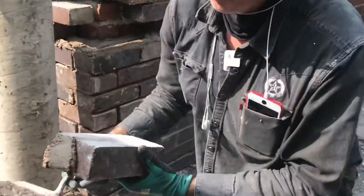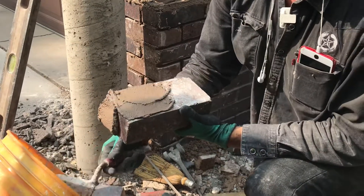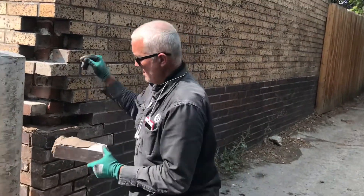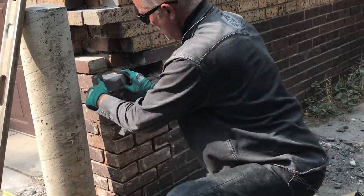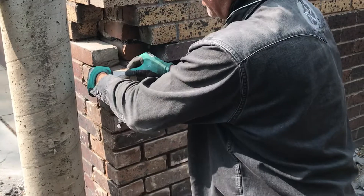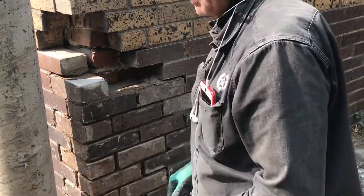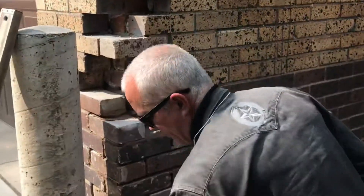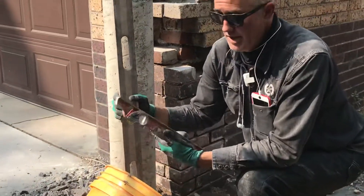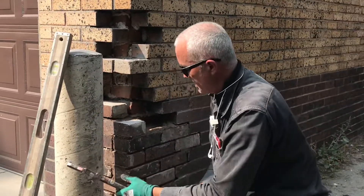You lay the brick into that slot with a brick above it. I like to butter the top of the brick. This is a lime-based mortar we made this morning. I like to make my mortar a little rich or a little stickier. You take your brick and put it in, minding where your corner is. Most of the time I'm not really using a level for this kind of stuff — I've been laying brick for a while. In restoration work on old houses, you usually have a nicer level than the brickwork actually calls for.